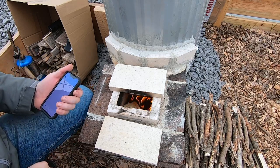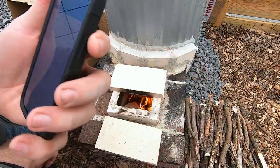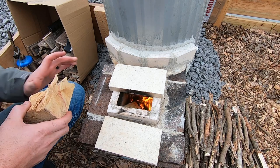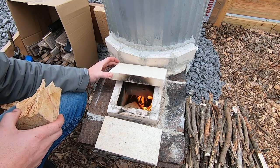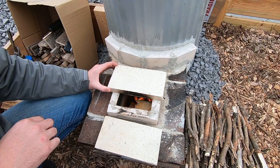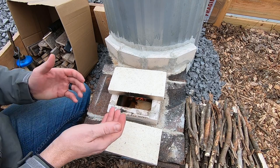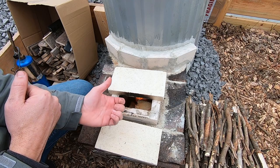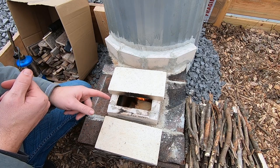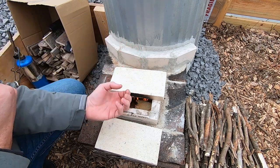We've been running now for about 20 minutes and it's gone up to about 60 degrees — 59.7 and rising. I added in a piece of the box elder maple — I actually just put that in. You can see we got a good burn going there, going in sideways. I'll drop in another piece. These things do love to be fed — they love to be full. It just gravity feeds it down slowly. It doesn't actually burn up. Side note: it can actually burn upward like a traditional campfire if you don't have enough burning down in the actual tunnel. If you don't have enough down there it won't pull it, then it will burn straight up. So it's good to have some sort of cover over the top here.